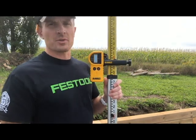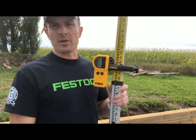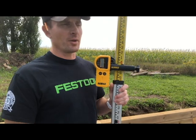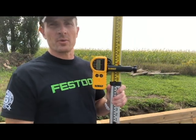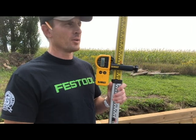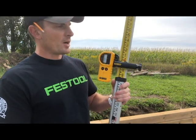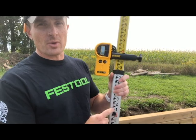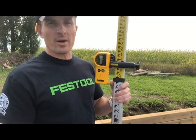I have to mark my opposite side. This is going to be an outdoor sport court, so I need a little drainage while keeping it as level as possible so we can put a rink out here in wintertime. It needs to drain along the 40 foot direction, and I want to drop a half inch over every 10 feet. So with 40 feet, that's four times a half inch — a total drop of two inches. I bring the rod reading up two inches to find that lower end elevation. As you can see, laser levels are pretty easy to use and set up, and the biggest advantage is you can use one by yourself.